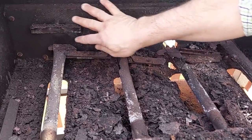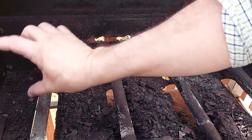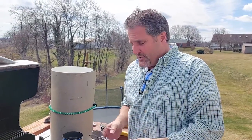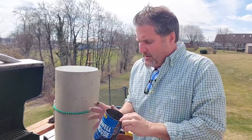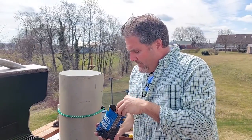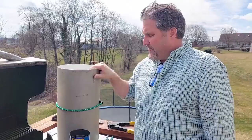What I'm going to do is clean all this off and pop rivet a new lining inside this grill. The only things you really need to do this restoration are a pair of tin snips, some pop rivets that are an eighth inch in diameter, and an eighth inch drill bit.